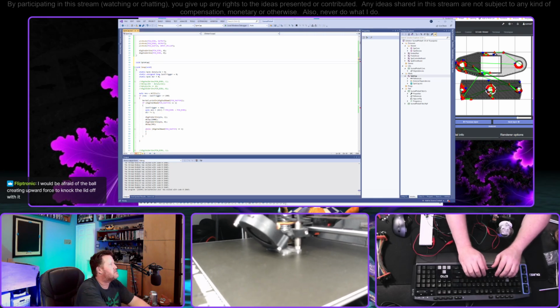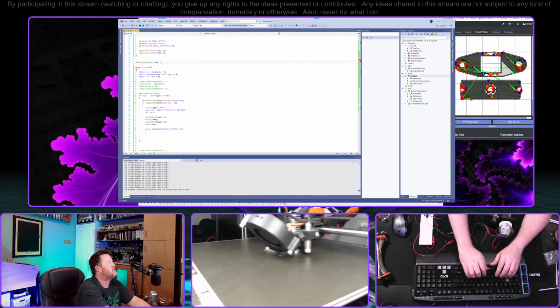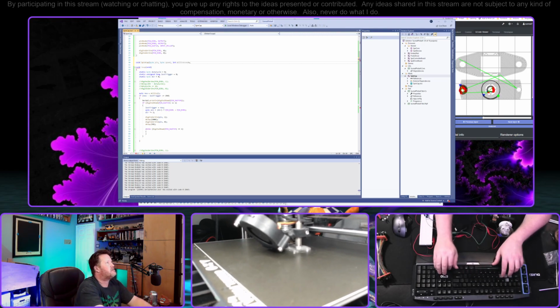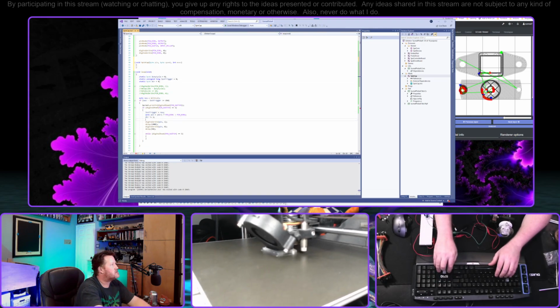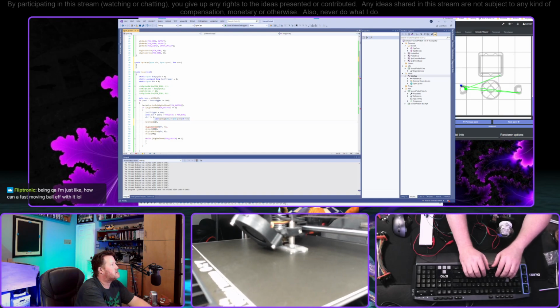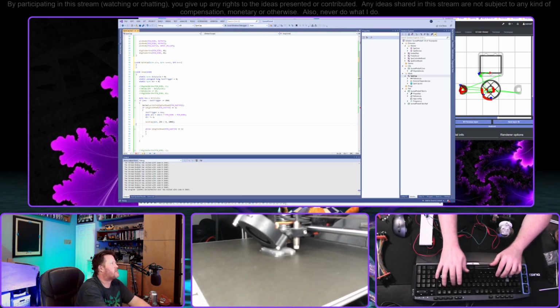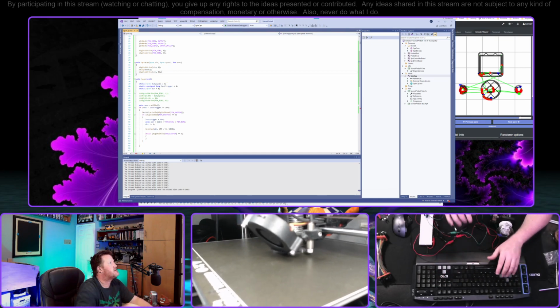Spin cap, we'll call it. All right, what are we going to put in here? Speed from 0 to 255. We want a pin that we want to do this on. Speed, and let's do milliseconds. Let's do m sec. And I think that's it. So let's switch this back to spin cap, pin, speed. Let's just start at 1/16th the speed, 1/8th, we'll do 1/8th, milliseconds, 1,000, there we go. And if we didn't actually worry about the speed at all, we're going to want to wait for msec, and this is not actually necessary.